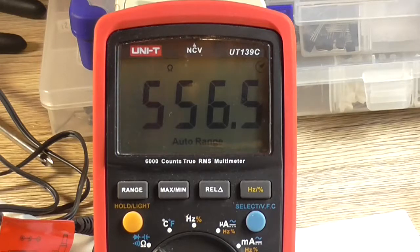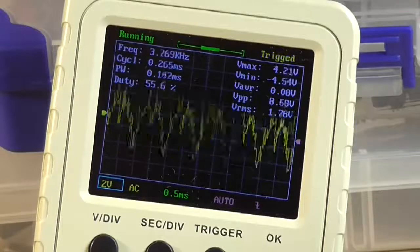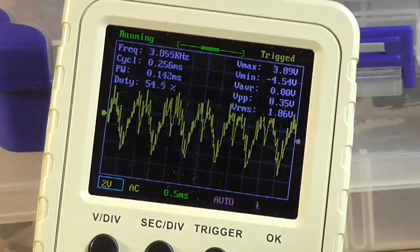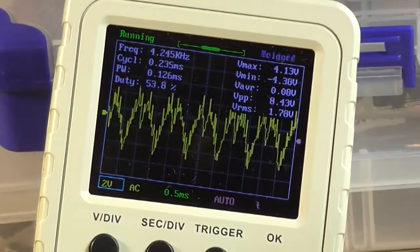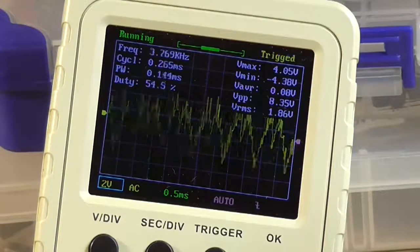I would say that would be a fairly high impedance microphone. So I've probably got the wrong resistor there at the input. I've got 680 for low impedance. High impedance should be about 1 meg. So with our 1 megaohm input resistor in place of R in, we're getting closer to 8.5 out of the entire circuit. So I'm not sure if that's going to make a difference to our microphone.